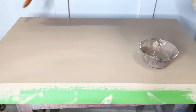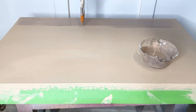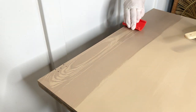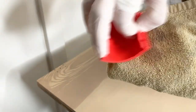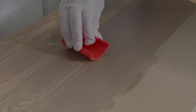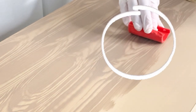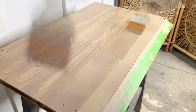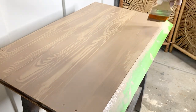Here you can see the contrast between the color I created versus the one I bought. You really only need to brush a thin layer of the darker tone. Now I'm going to take my wood graining tool and use a rocking back-and-forth motion as I'm gliding it across. It's always a good idea to keep a rag handy so you can wipe off any product that accumulates on your graining tool. It is recommended that you work on smaller sections at a time, especially on a large surface, to ensure that the product doesn't start drying out before you start gliding your tool across.